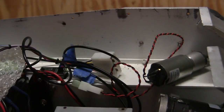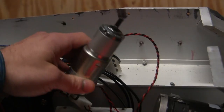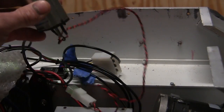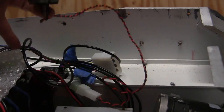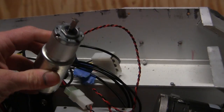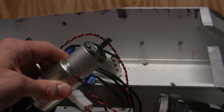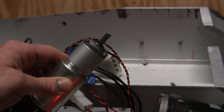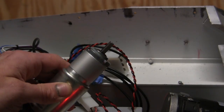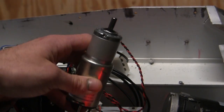In addition to the other RC functions, I am also in the process of calibrating and hooking up the tank's turret rotation. That's facilitated with this motor, which is stock Armortech and simply plugs into the auxiliary power box discussed earlier, and is mounted on the side. If I move the stick on the radio, the motor rotates left and right, which is what one would expect for a turret rotation.